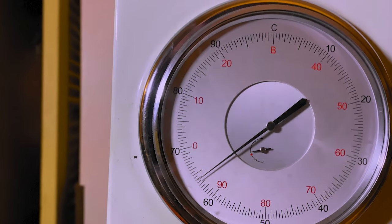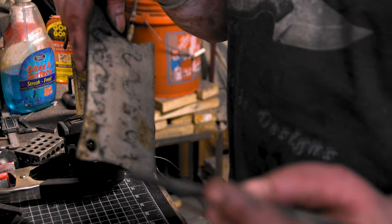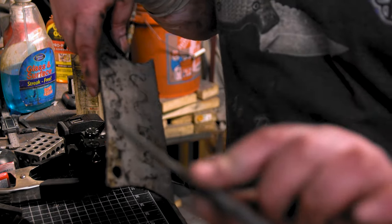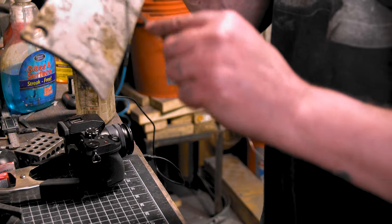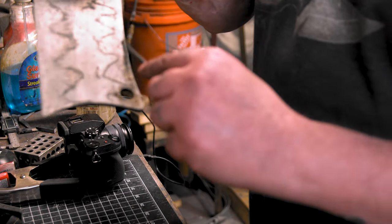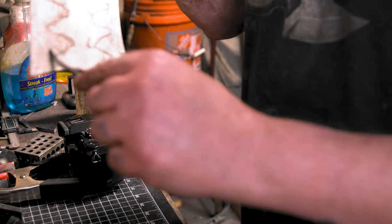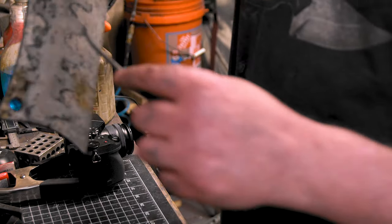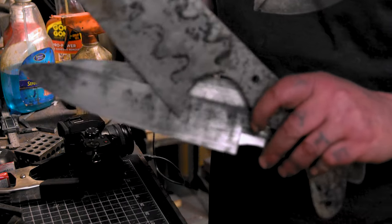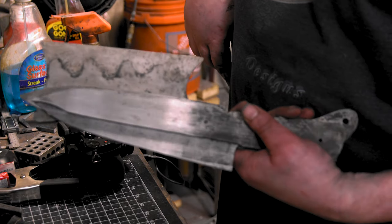All right, first kitchen knife, about a 64. Here's the cleaver, 65. Boom, probably won't see that. 65, doesn't even touch it. In the back, it bites here because that's where the clay was. But here, nothing. I think I can get all these in the tempering oven. I might have to do some caddy cornering and magic, but we'll get it to work.